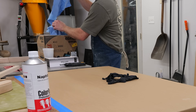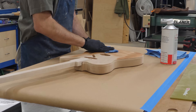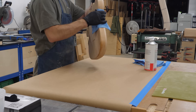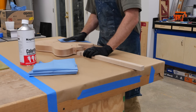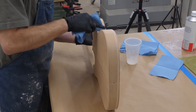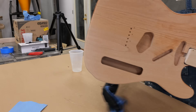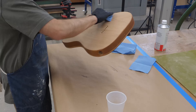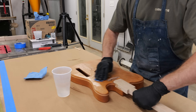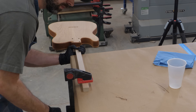In the past I've always dreaded the finishing process, and while I'm far from wanting to open up a paint shop, I'm finding that I'm less intimidated by finishing than I once was. I think it really just comes down to getting your hands dirty, spending the time to try different methods, and as tempting as it may be, not rushing through all of the prep work. There are two approaches when it comes to applying epoxy as a grain filler: one is to use a squeegee to spread out the epoxy — it's a little easier to end up with ridges going this route, which can leave you with a lot of sanding afterward, but sometimes you can get away with fewer coats because it goes on a little thicker. I like to use a lint-free rag like a chem wipe to apply the epoxy instead, which allows me to work it into the surface like a hand-rubbed finish with thinner coats.